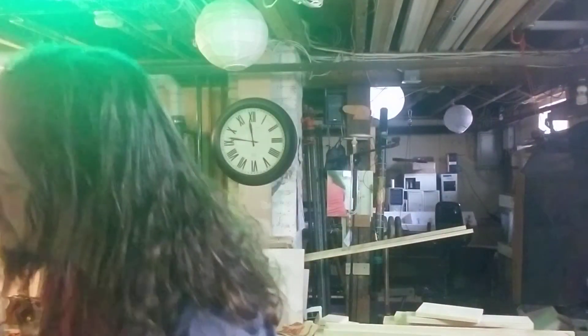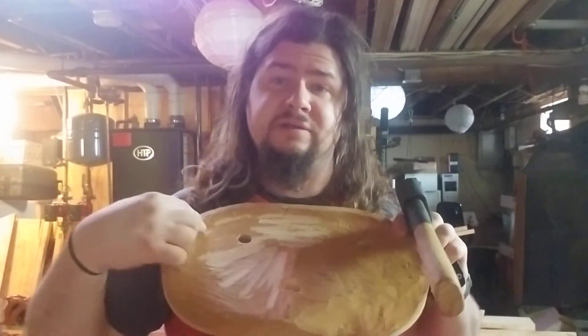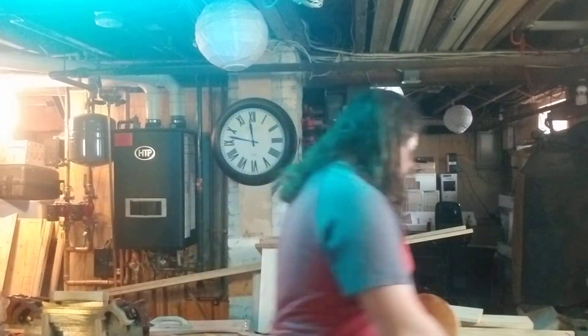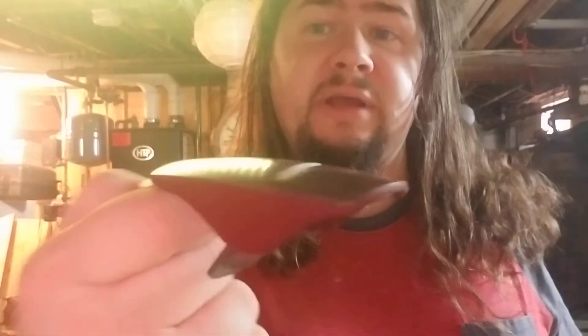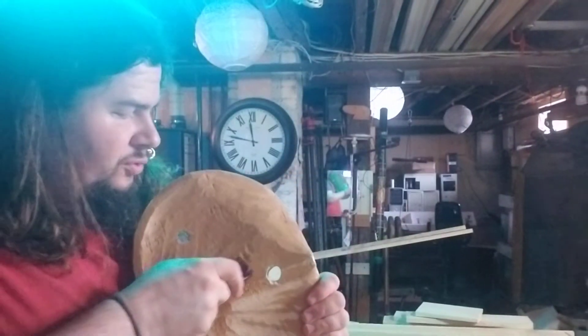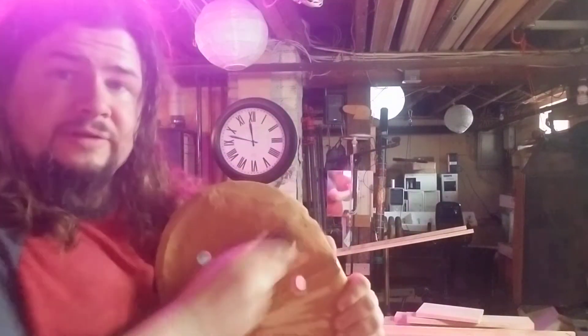You could also do a power carving technique — there are things called a turbo plane that you can put on an angle grinder. I would suggest marking out a few pencil lines for what you think you might want: usually a ridge between the legs, maybe a line near the back. Feel it out, sit on it, try it, go back and try to do the same thing to each side. Another tool you might like — I've recommended squirrel-tail planes before — there's one on Lee Valley for a little under $50 that is double convex, convex both ways, and it's really good at following these curves if you're making a curved seat.